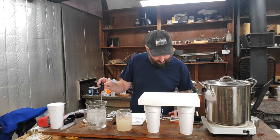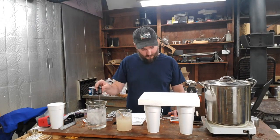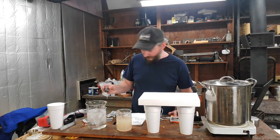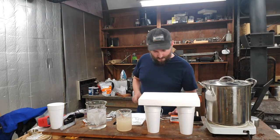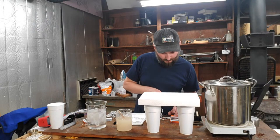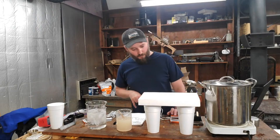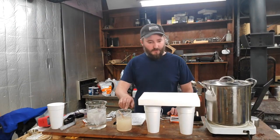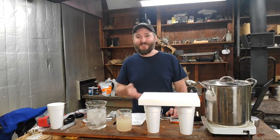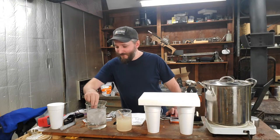All right, let's see what our temperature is. All right, so these 2 cups, in scooping them out, they became 1 degree Celsius different from one another. One of them is 85.8 C, the other is 84.9. I am going to put my phase change material in the higher temperature because I want it to have a little bit harder of a challenge than the ice, to make sure that this test is done fairly or even a little bit unfairly in favor of ice over my material.